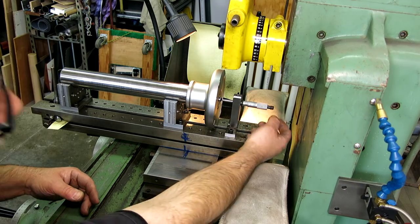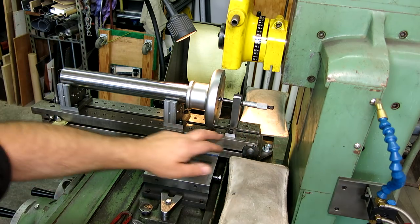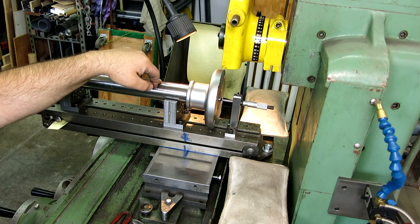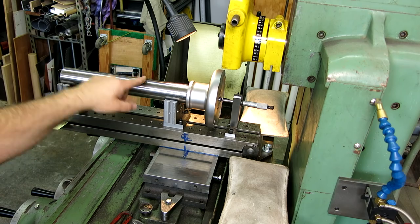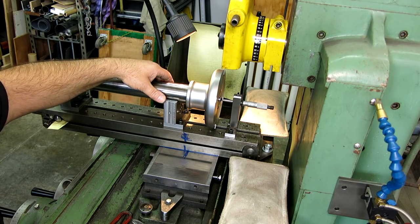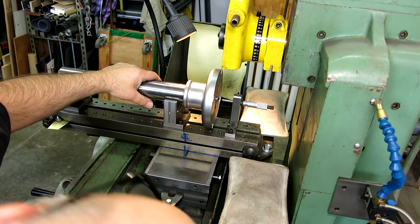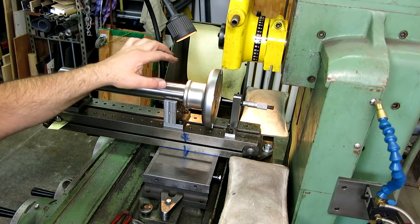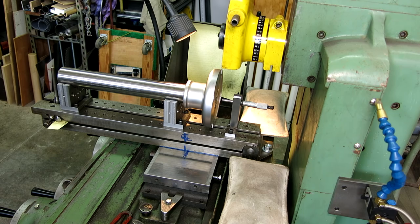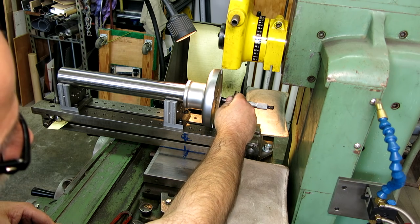Now, what we have here is a micrometer stop, and it's probably hard to see, but there's a ball in here that's sitting in the center of the grinding center of the pin. So we're just going to push up against that and then turn this. And if we want to disengage with the grinder, we can come out a little bit. And I've got it kind of, whoop, okay. If you heard that little tink, that was the ball falling out. I probably have to use something a little bit better.